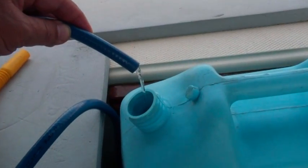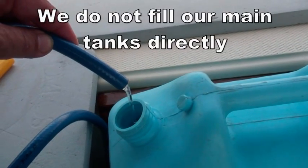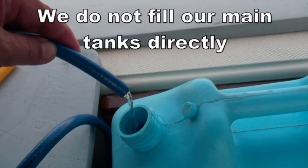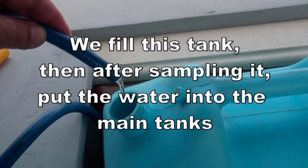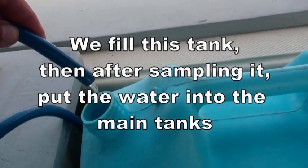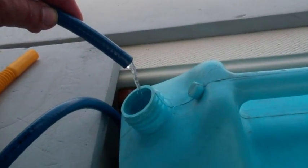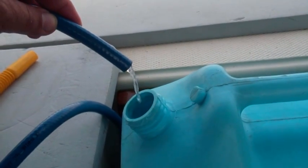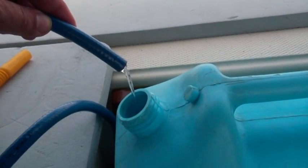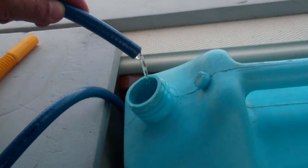Take a look at what that looks like in reality. When choosing a water maker for yourself, think about how long you're going to spend babysitting it, as we don't leave ours running when we're not aboard the boat. In the heat of the Sea of Cortez, if we're not using the unit, we normally back flush it about once every three or four days. If it's going to be longer, we pickle it.